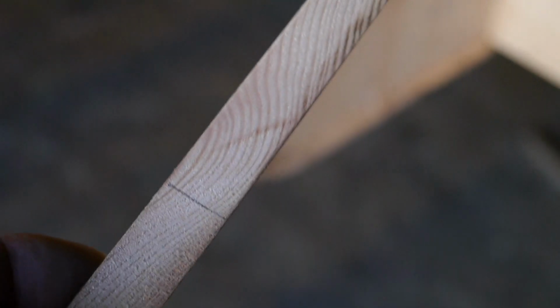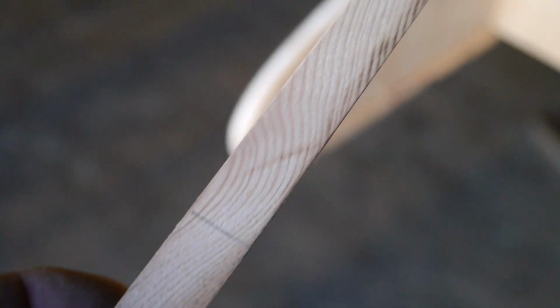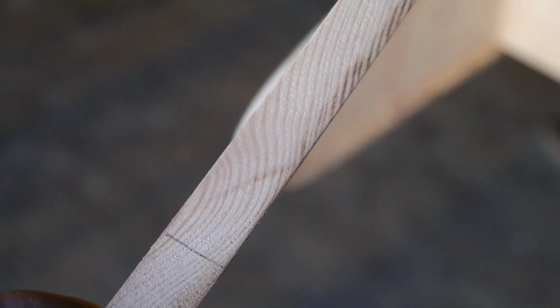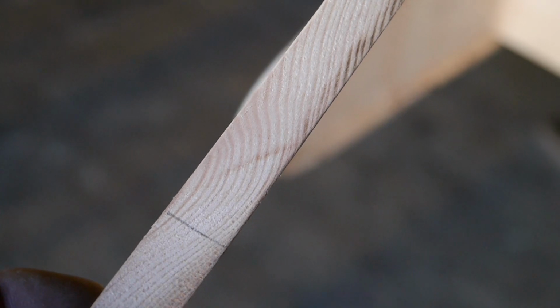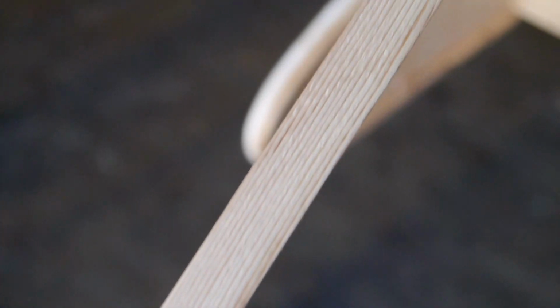Here a little bit about wood quality. This one is in principle a very nice stringer. And then suddenly this comes. See? That's a knurl. There was a twig growing. We can't have that. We can't use that. If we would use that, we would increase the risk of the stringer breaking. So we cut out these bits and use the stringer only in positions like from there on.